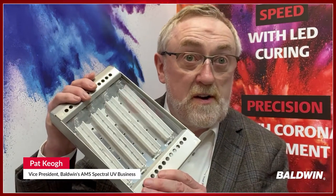One of the challenges today is the cost of energy in the printing world, and also machines are getting faster and faster. So we went away and developed a brand new IR hot air system. Here you can see in our unit we have these special IR lamps — they're patented lamps. They've got a very special ceramic jacket around the outside of the lamp that collects all of the IR and directs it right down onto the substrate.